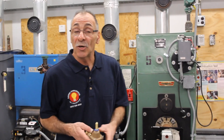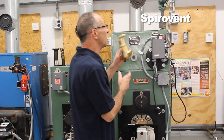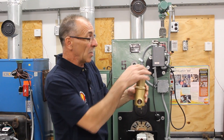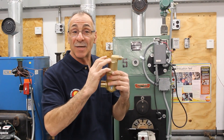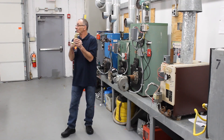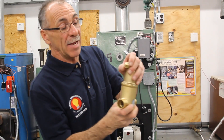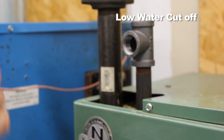This is the spiral air vent. It goes on top of your boiler on the supply line. Air will come out through this little vent here. Please do not shake it — there is a float assembly in here. As the water is breaking down through the screen, it processes the air to go up. As the air goes up, it comes out here.